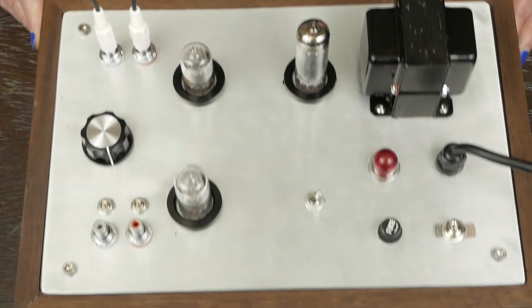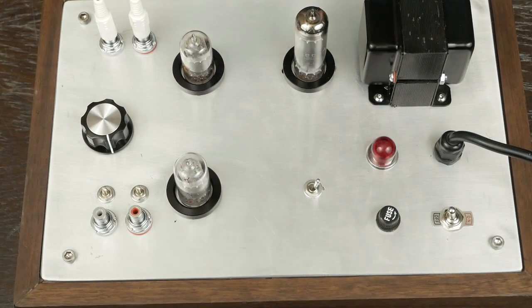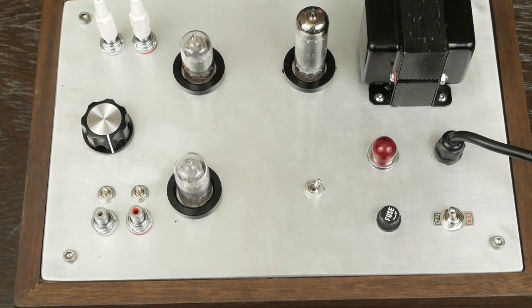So we have some idea of what this thing's going to work like with a 20k load on it. Let's hook this thing up to the audio analyzer suite again, and hopefully get some final measurements, and I think I am going to put it back on the scope. I want to see what the 100 Hz square wave looks like with the bigger capacitors, so let's get busy testing.